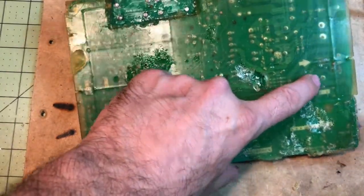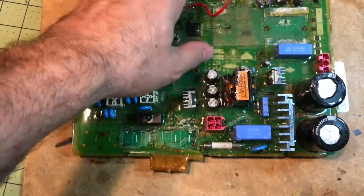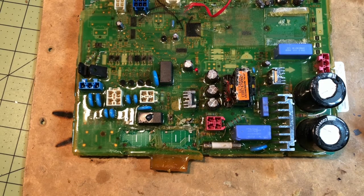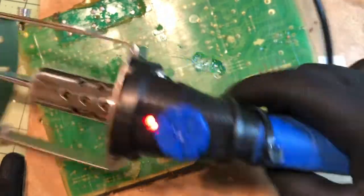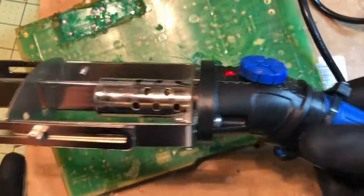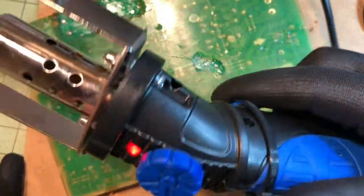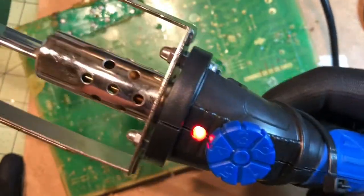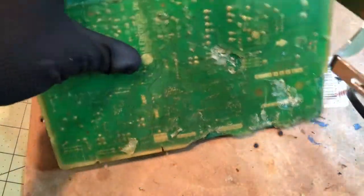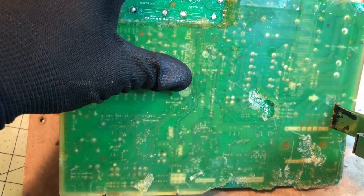Here we have two pins for that capacitor. I'm going to get my gloves on. The hot knife is about 30 bucks on eBay — I'll put a link in the description. I put a zip tie on this button so it holds it down to keep it hot all the time. If you don't press the button it won't get hot. When you feel it get to the PCB it just kind of stops.